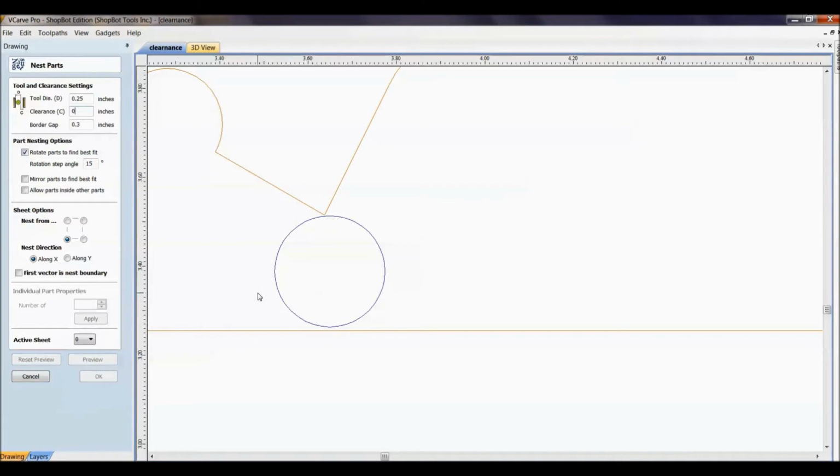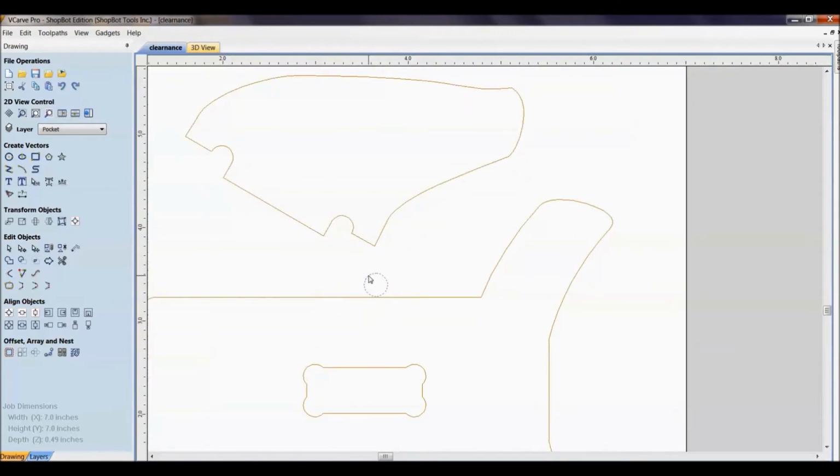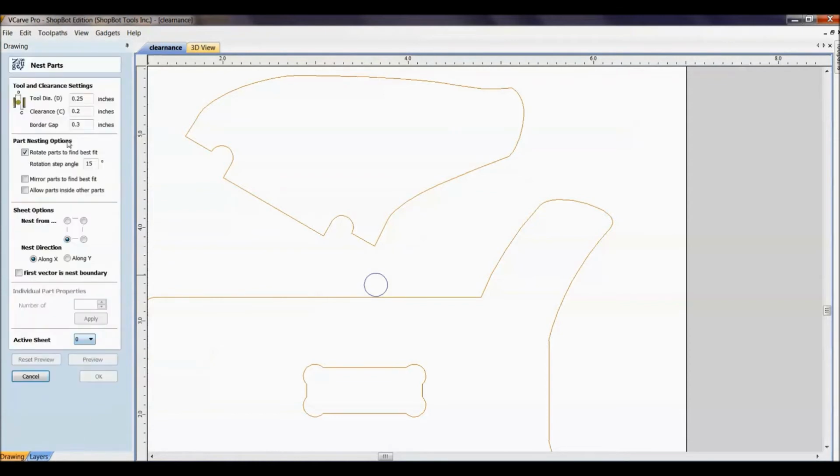So if you're looking to get an efficient cut where you're cutting both parts, if say you have parallel parts where you're cutting along in between, you could be doing both edges at once, but you've got to be careful with that because it could be doing a climb and a conventional cut, one on one side, one on the other. Most of us, when we're cutting, will actually have this with a space in between. One, because we need to have enough material in between, because after something like this that needs to be tabbed, we need to leave a little bit of meat on the bone. So right now, if I was to measure what this is here, that distance apart, that 0.28 of an inch, that would correspond to what the clearance is. So we'll look into that a little bit further when we get into our example.